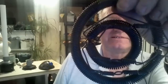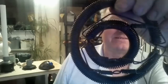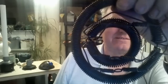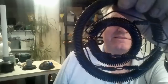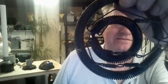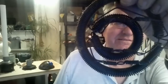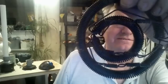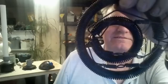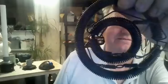But the idea is that it acts like an oscillator. At one end of your coil where the gap is, say one coil on the right side of our screen here, you have the gap, and then you have the other gap in the smaller coil about in the middle of our screen. The two ends where they come together with this oscillator are never even, and because of that, there's always an imbalance, and because there's an imbalance, it starts to oscillate from one side to the other through the coil, and then it becomes an oscillator. You can have a series of them, and they either concentrate down or disperse out, and they resonate at different frequencies. If you have enough of them, there'll be one that's self-resonating and makes the other ones go, and so on. So it becomes more of a self-resonating circuit, and they actually make it in nanoscale now too, for antennas and whatnot.